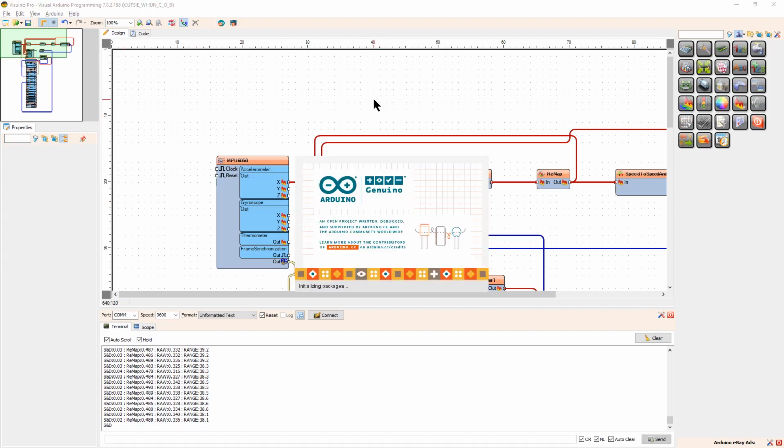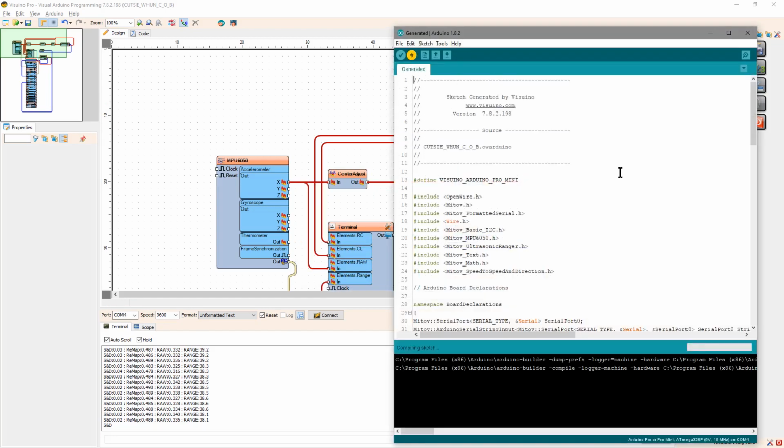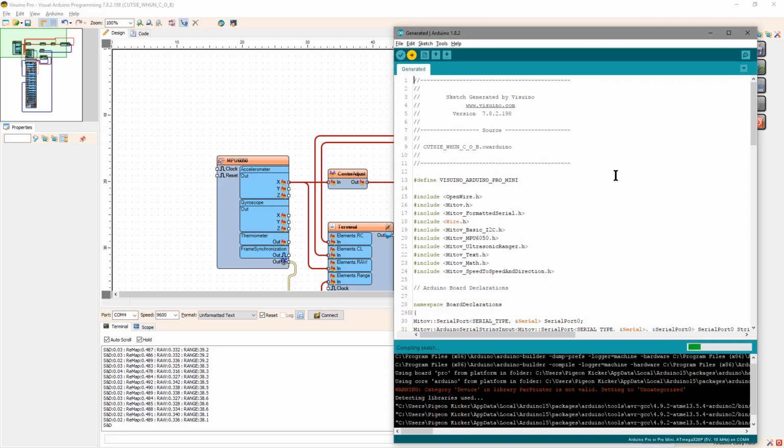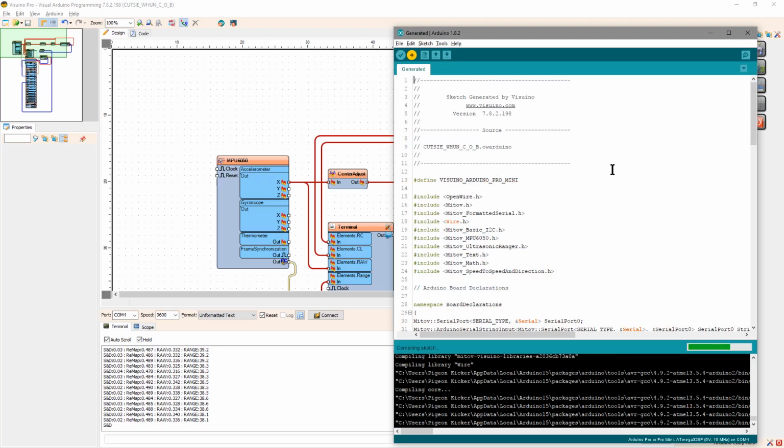That is before any Kalman filters, that's before any complementary filters, before anything. Because to get a good stable signal, you have to have it stable first. So you gotta do the filtering and everything I found before. Because as I was trying to do the Kalman filter and everything, it was jumping all over the place because I didn't have a stable zero. Center point, balance point for it.